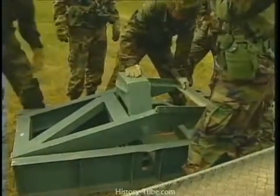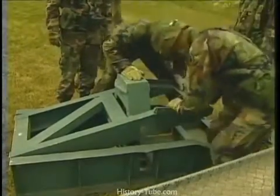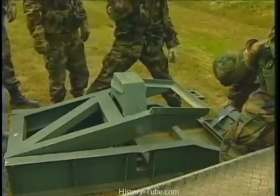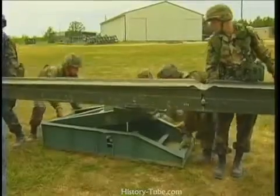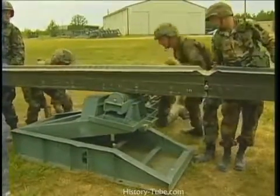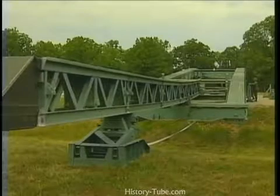Its nickname is the guillotine because it is extremely heavy and has been known to slip, crushing soldiers' hands and feet. Position the landing roller pedestal with its base centered under and parallel to the launching nose, 9 inches in front of the F peg.